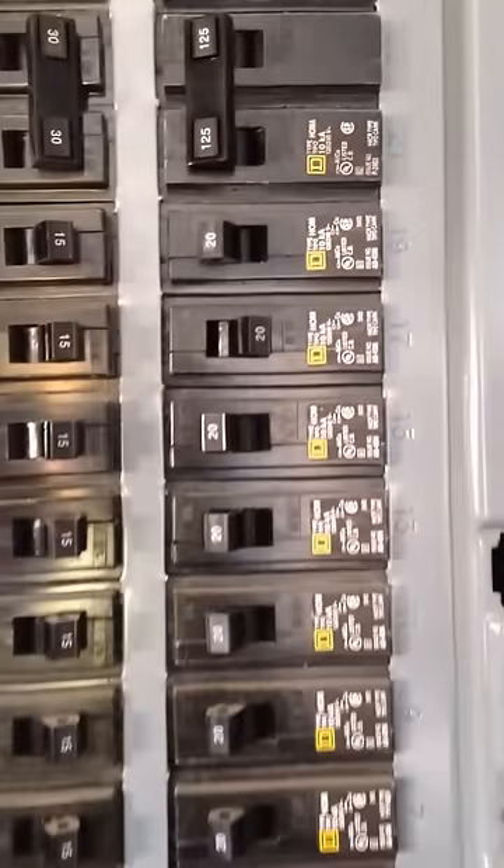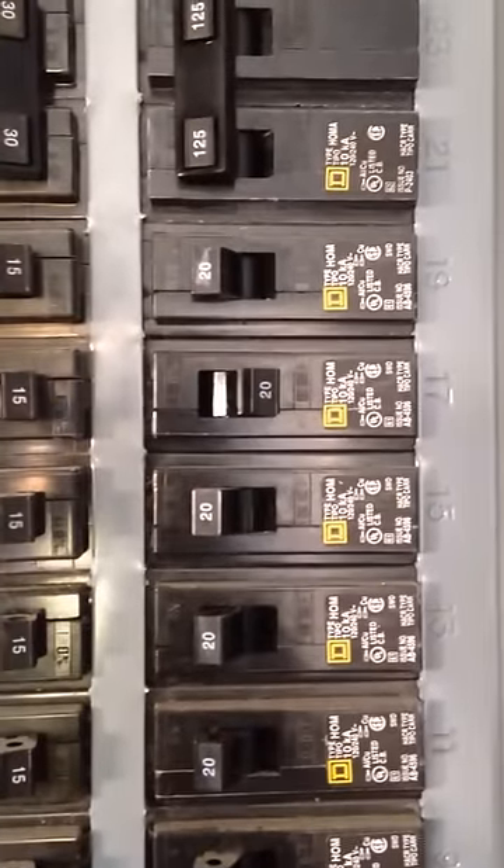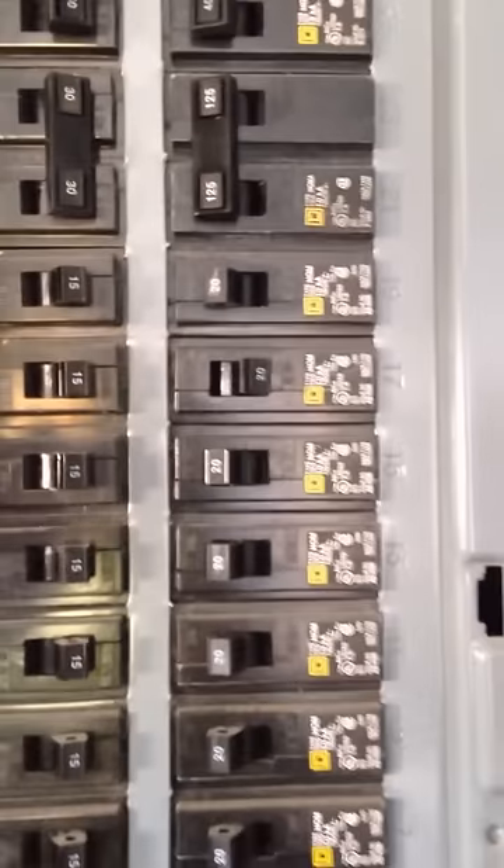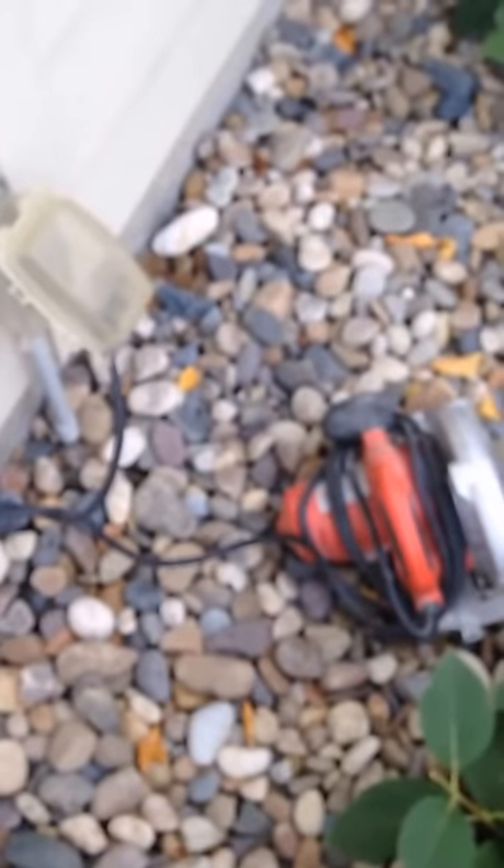There, I located the circuit breaker and I turned it off. Now I just want to test the outlet and make sure there is no electricity there. I have a circular saw plugged into the outlet just to make sure it doesn't start if I turn it on.